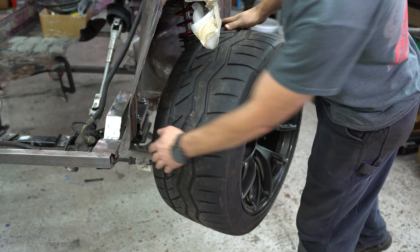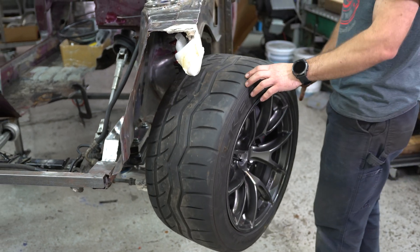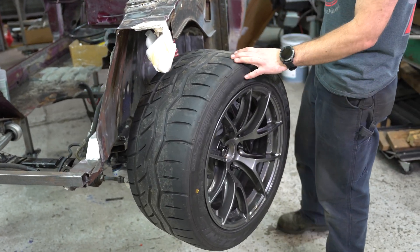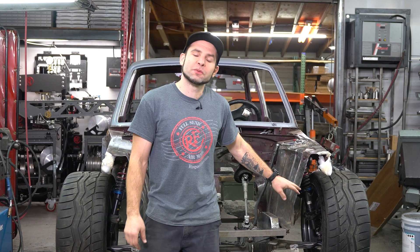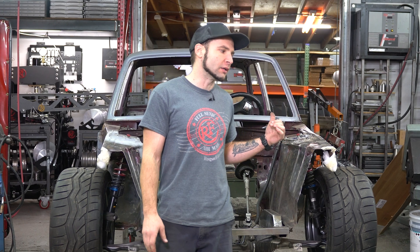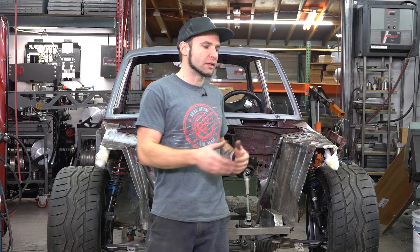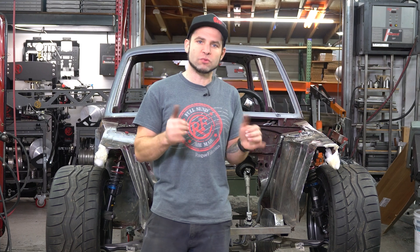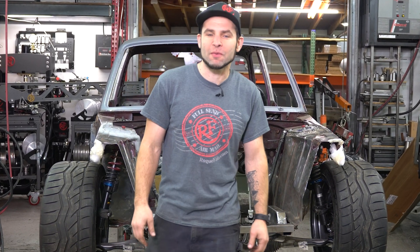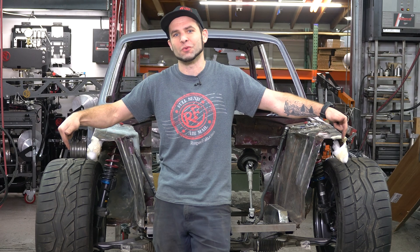That's full lock — so we've actually got plenty of room in the front. We don't have to do any work there, and we will be trimming our inner fenders a little bit. So this is good for clearance overall — really good. We're super thrilled with the steering clearance. There's a little bit of trimming required at the firewall, which we definitely expected. The axle centerlines kicked forward about three-quarters of an inch from a stock BMW 2002, and part of that was to gain clearance for the extreme steering angles that the E46 has and the substantially wider tires. So we're really happy with how the fitment's coming out. Tune in for Episode 4, be sure to subscribe if you haven't already, and check the bell to enable notifications. We'll see you guys there.